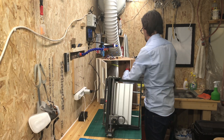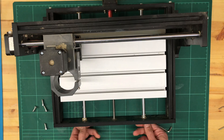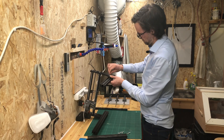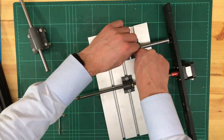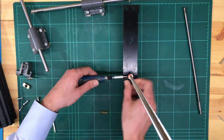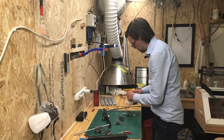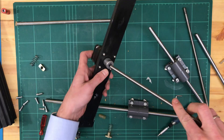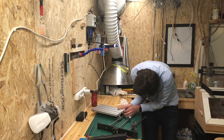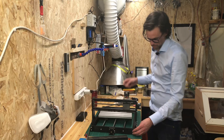This extension kit is known as a 3040 extension kit. That's a bit of an oversell, but we'll get somewhat close to it in the end. In order to mount it, I have to extract my CNC from the enclosure and disassemble it. The X-axis gantry has to be separated from the base, the cutting table removed, and the Y-axis lead screw removed and replaced. The same goes for the Y-axis linear rails. The connector between the stepper motor and the lead screw is replaced as well, as the new couplers are flexible as opposed to the old rigid ones. I reassemble and mount the table again, roughly positioning the X-axis gantry.